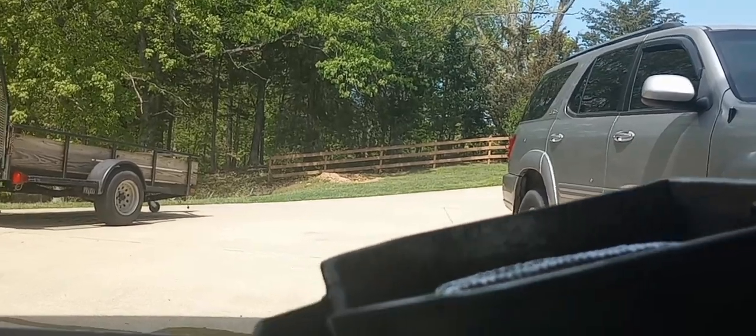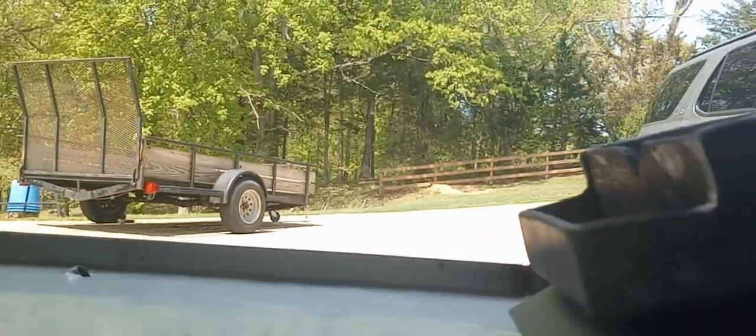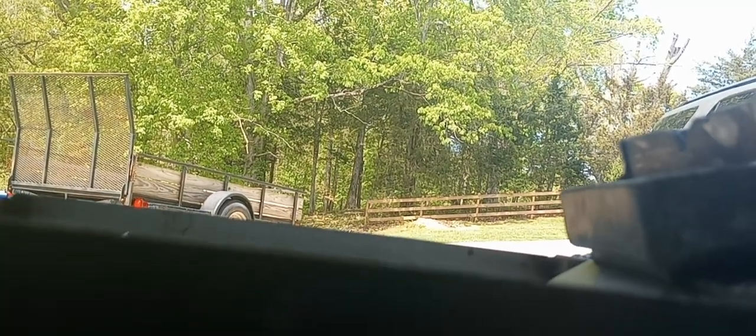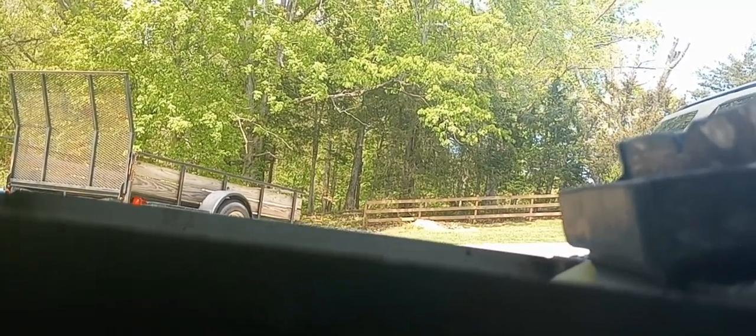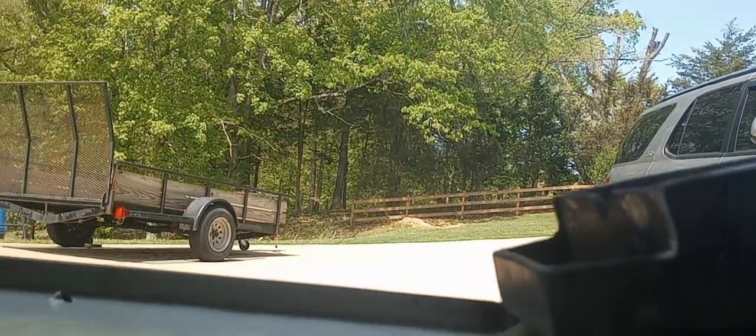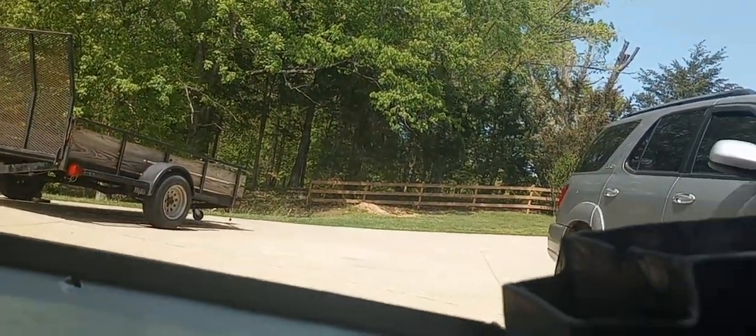Okay, I put the pot onto the burner and got it adjusted. I'm going to see if I can get down here and show you the bottom of this. If you'll see, the back of that lip is just almost touching the metal where the burner is sitting. I leave just a tiny little air gap in there, and I don't want it sucking any heat away from that lip.